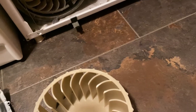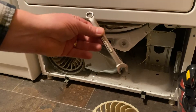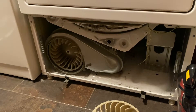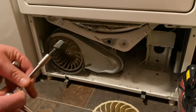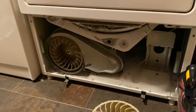The next thing you have to do is take your 7/16-inch box end wrench and go right behind this metal housing and put it on — there's a hex shaft behind there. Once you do that, take your half-inch square drive socket and put it in the square hole and turn it clockwise. I've seen some instructions where they have you tear the whole front panel off, take the drum out, remove the belt — all that work — but it's really not necessary.